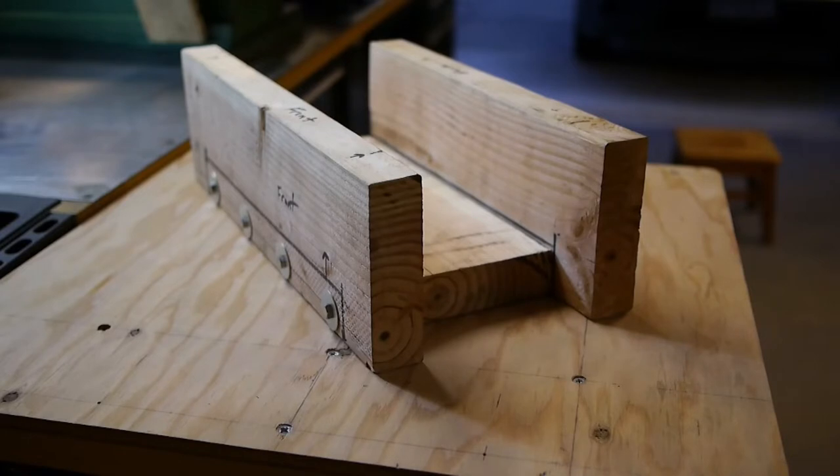Here's a picture of the cradle that's used to move the lathe. It's set up so that the width is enough to encompass both the lathe bed and also the lead screw and lead screw cover. The front protects the lead screw. The bottom plate is the length of the flat area on the bottom of the casting on the lathe bed. This is all made out of two-by-six dimensions, which actually fit the lathe very nicely, and it's all lag-bolted together so it's really quite sturdy.